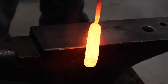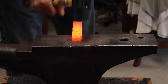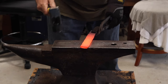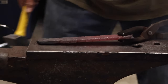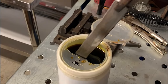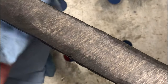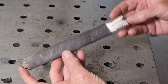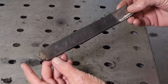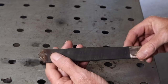After I had the twist done, I went ahead and just flattened it out and drew it out some more. Once drawn out further, I took it over to the angle grinder, tried to clean up the edges, and then I wanted to do a test etch just to see if I could see any of the pattern. At that point it was probably 1/4 inch thick and about nine inches long — I needed another inch and a half of length and at least another half inch of width. But so far this one was looking good.